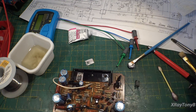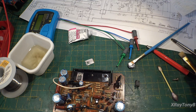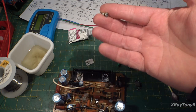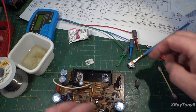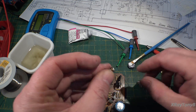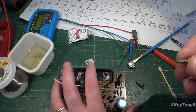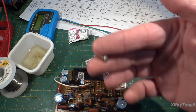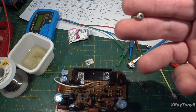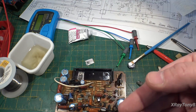When I took these out, the screws were so loose I could loosen them with my fingers. I found this a lot in this amplifier — rather than the heat sink contact just providing thermal transfer, this screw is actually an electrical conductor for the collector. So if it loosens, you now have a resistor between the collector and whatever it connects to. Over thermal cycling year after year, if you're not getting good contact, who knows what it's doing to the circuit. Worst case, it could throw the bias off or contribute to the notorious oscillation problems.